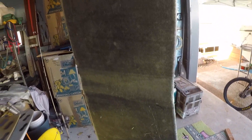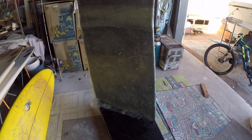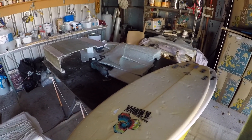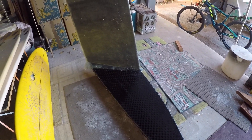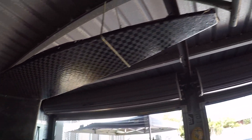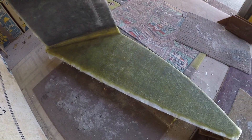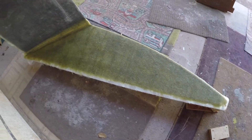It's already starting to pop out of the mould, which is one good thing, but I hope it doesn't all peel off before I get every layer on. I think I'm doing five or six layers — I've got all the stuff cut up. I'll do up to eight to ten layers, and if I need to put more on after I pop it out of the mould I can strengthen it then — see how we're going for strength and flex.